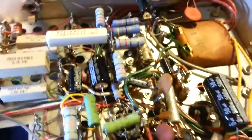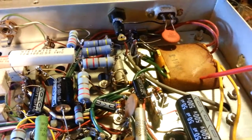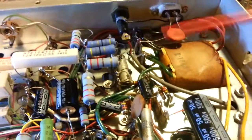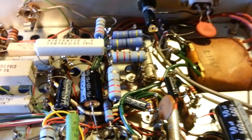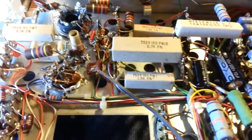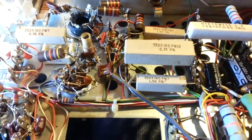The reason I say that: the only Tram D201 radios that I have personally ever worked on that had power transformers that burned up, I mean literally caught on fire, flames shooting out of them, the only thing they had in common was that both of these resistors were bypassed. So that should tell you something. You're asking a lot more of the radio. It's going to be drawing a lot more power when you do that.